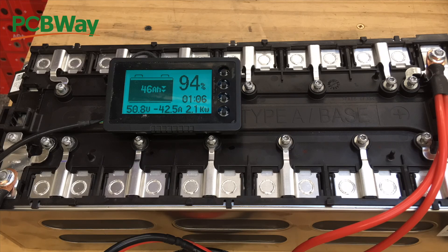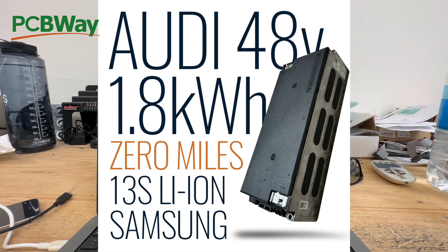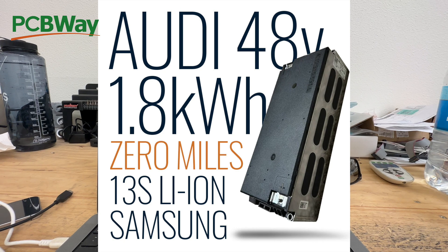While we wait, let's test the capacity of this battery — see just how much energy is stored inside. It looks like 38 amp hours. We started with 50 and ended up with 12 amp hours right before voltage collapse. Subtract 12 from 50 equals 38. So 38 amp hours, or 1.824 kilowatt hours — 1.8 kilowatt hours in each one of these modules.